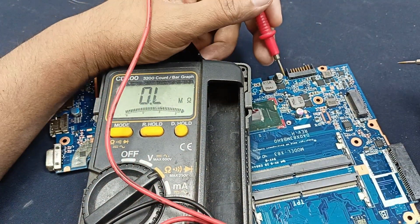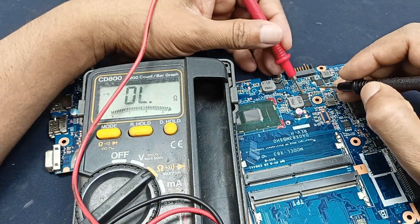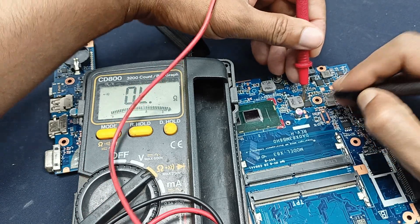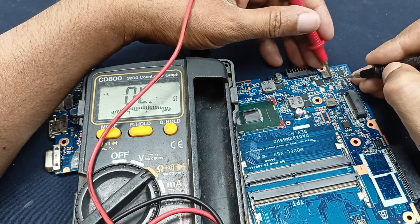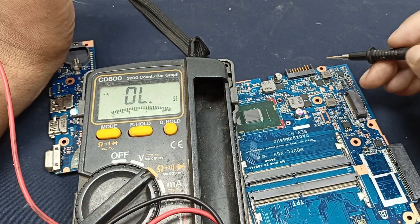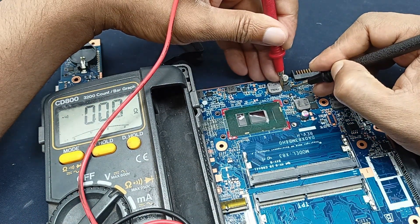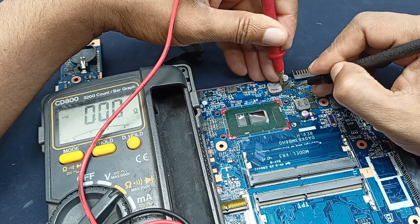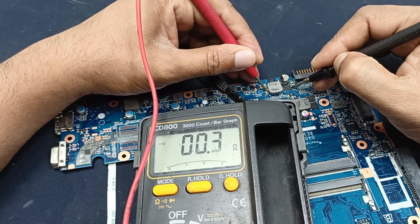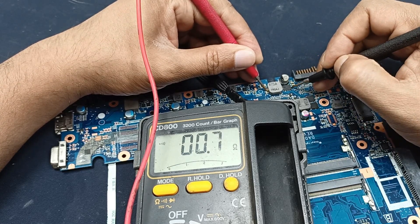There is some more to find out. Let's check some of this MOSFET — this voltage is also okay, 3.3 volts for the battery BMS, that voltage is also working. Let's check this MOSFET. Yes, this MOSFET is shorted. This line is connected with this inductor — I can probe it here and here, and you can see this is 0 ohms, which means this MOSFET is shorted.